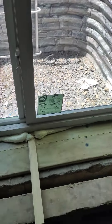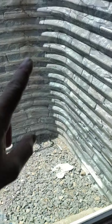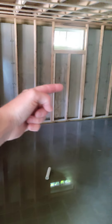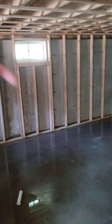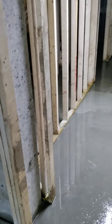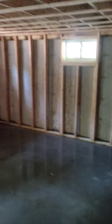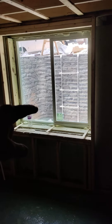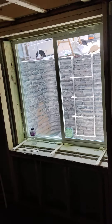We're trying everything here. We have another drainage pipe in the back for this pit, which is going to be covered anyway. That pipe goes down around the back, because this is the top of the hill — all the water hits the back of the foundation here, so we're trying to collect it at the source. That perforated pipe goes all the way down into a deep stone pit in the back corner of the house. And we're going to put even more drainage pipes in for the downspouts and the driveway shedding, which will go into another pipe system running out to the front and into a storage tank connected to the city water overflow.